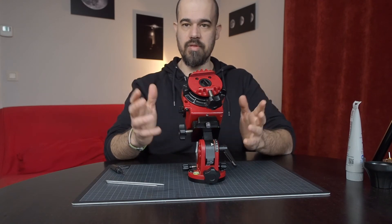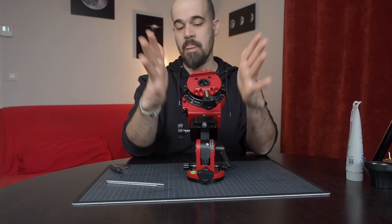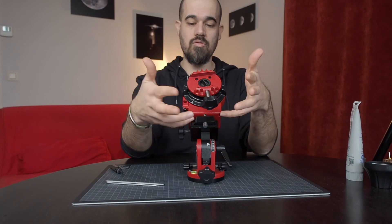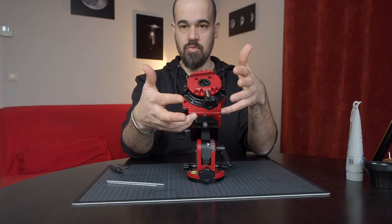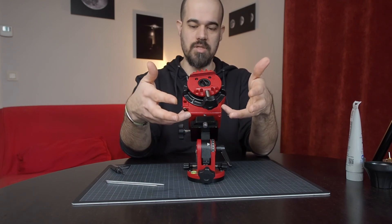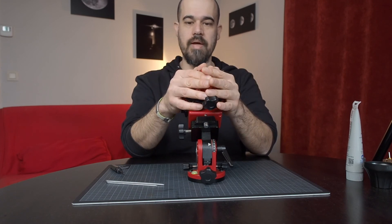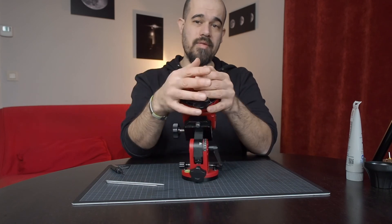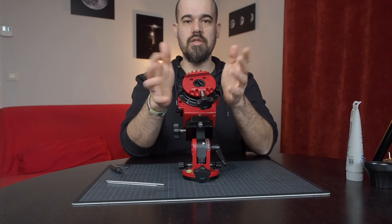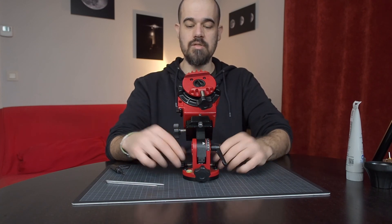This gives you the opportunity to check if there is any issue with motor stall. If you have motor stall, either something external is preventing the rotation of the payload — like a cable — or something is wrong in the assembly, or you have simply tightened the worm gear meshing adjustment screw too much. If so, you need to open the Star Adventurer, pull back the worm gear assembly, and start over. Remember: if you have a tight spot during free rotation, do the meshing adjustment at that spot, because a little backlash there will prevent the motor from stalling when it reaches that point. This concludes our series about the maintenance of the Star Adventurer — I hope you enjoyed it and let me know if it works for you. Thank you.